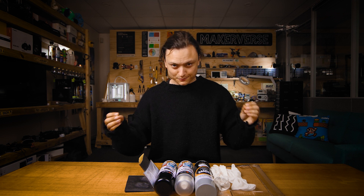At every layer it is important to wait until that surface is dry enough to work with. This is normally going to take an hour or two, even though it says 15 minutes on the cans. Spray paint can be deceptive and look dry when it's actually really wet — by shining a flashlight on the part it will reveal whether it's wet or not. That hour between layers is enough to work on the components, but the layers are still going to be mushy and prone to fingerprints marring the surface. So for the final layers between colours, do not sand or touch the painted surface. Then the post-processing will be complete.